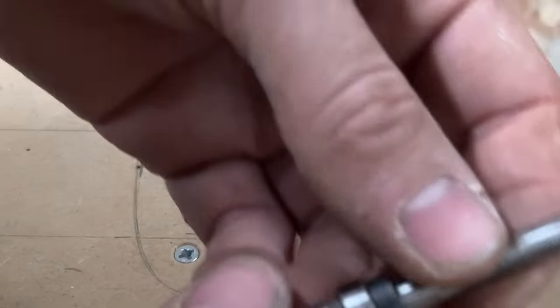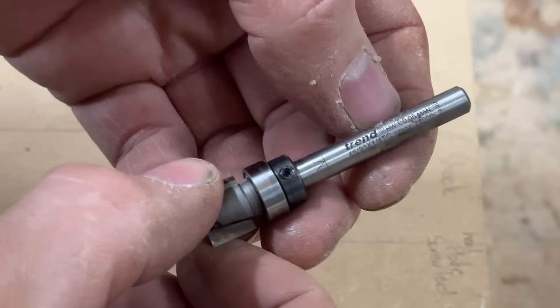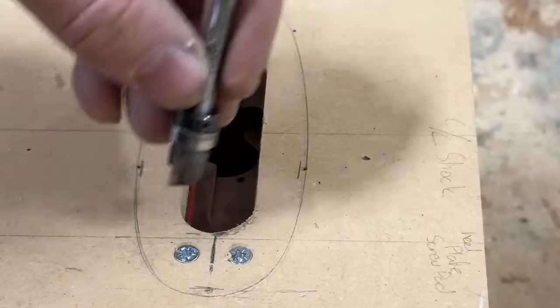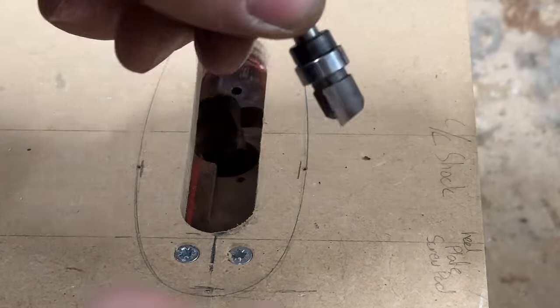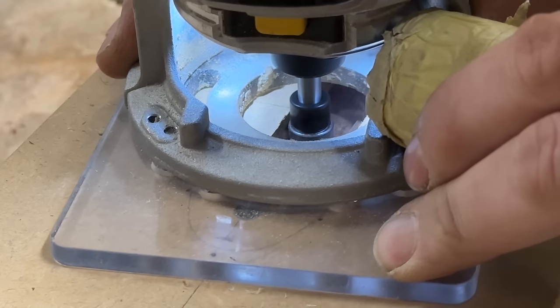With that jig in place, I'm just going to use one of the flush trim router bits like this. I'll leave a link to the Trend version of this cutter in the description. These are the best ones for this type of jig. They run flush with this edge and trim about 9.5-10 mil of material away.